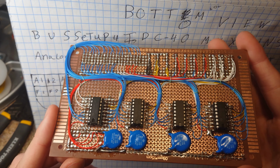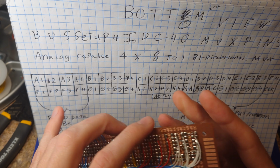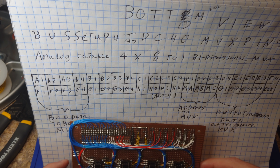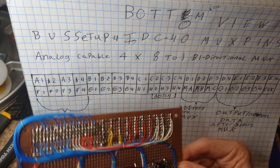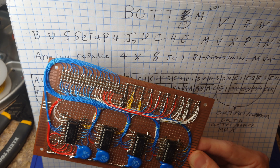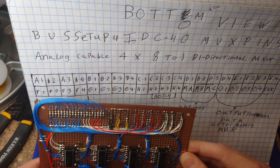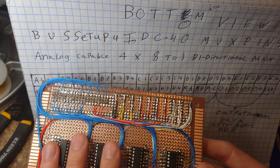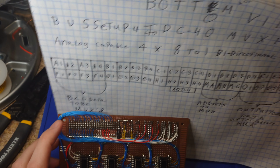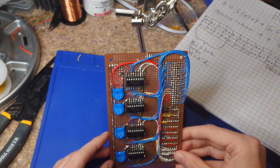I went a little bit overboard with the coupling, decoupling on here, and I bodged this one on because I didn't like how far the power line had to run over there, and kind of unnecessary. Something to keep in mind is this is actually an analog demultiplexer. Now with these long wire runs, even with the nice looming, we're probably not going to get anything north of 100 kilohertz, or maybe that's optimistic. These chips are maxed out at 10 megahertz or so with a 12-volt bus on the data sheet. But these are probably fake chips. They're cheap. That doesn't mean they won't work.